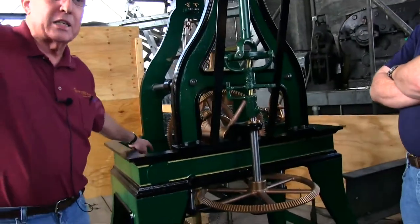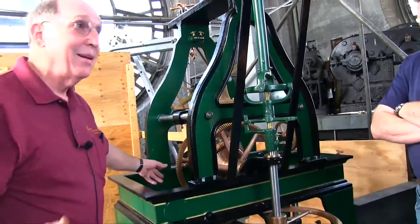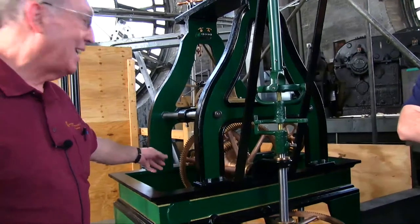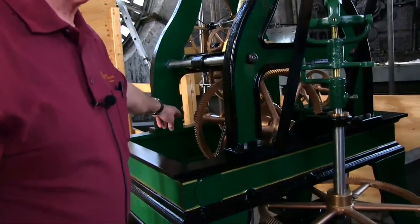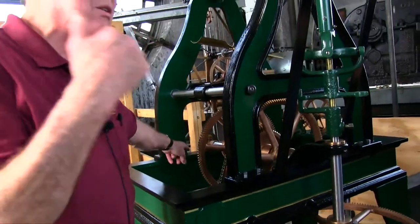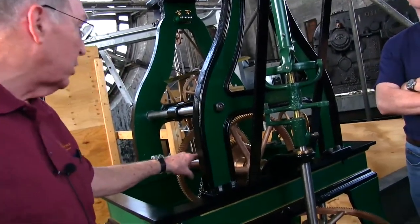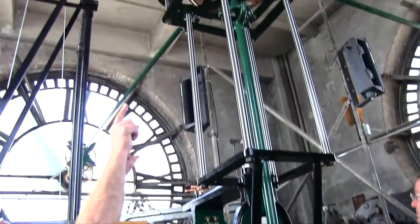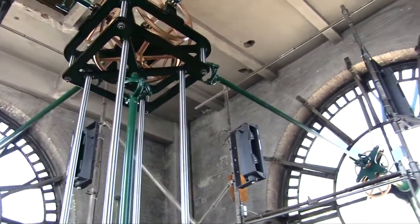Do not set the clock by turning your finger on the pilot dial — don't touch it. We've seen it a hundred times. The pilot dial is what it is — it tells you what time it is outside. You connect that straight through and hook to this gear, driving this gear, follow it up, and it branches into four different directions. Each one of those shafts is turning one revolution per hour.